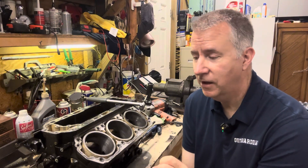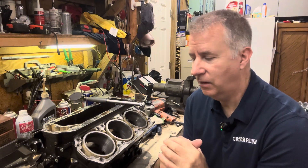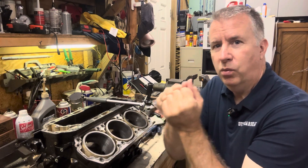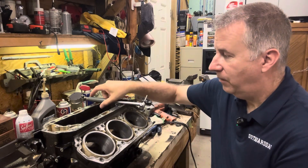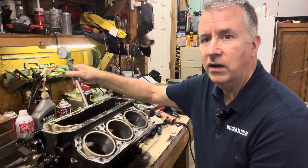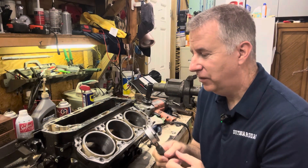I looked up some Mercury parts and there is an aftermarket through Pro Marine that you can get these pistons. I've had very good success with Pro Marine pistons - I've weighed them against the original pistons and they weigh almost exactly the same. The way they're designed and the forging is the same. In my last video as we were honing the last cylinder, you could hear it wasn't an even boring like in the other two. So I got my dial bore gauge out, zeroed it on one good cylinder, then went 90 degrees, then 45 and 45.